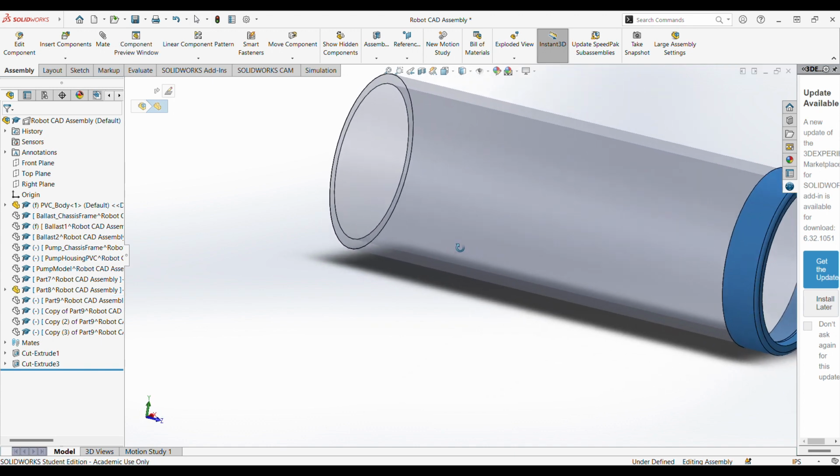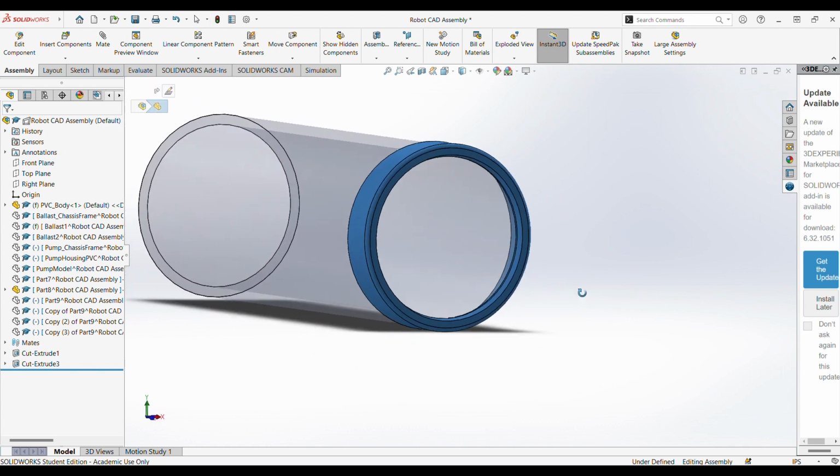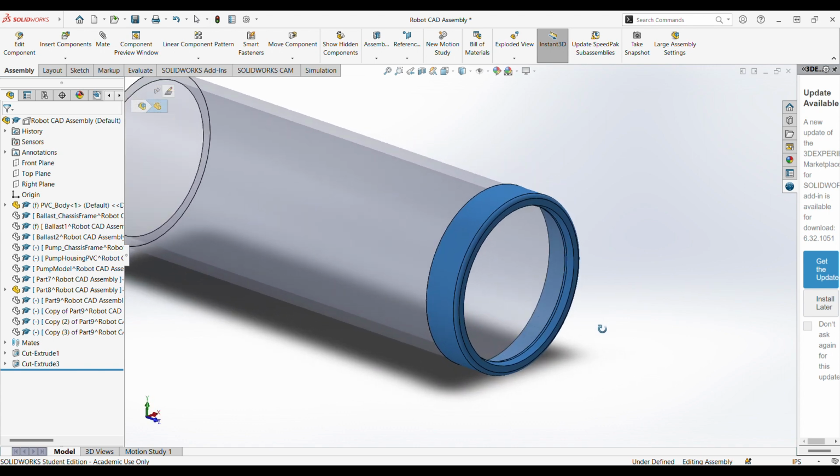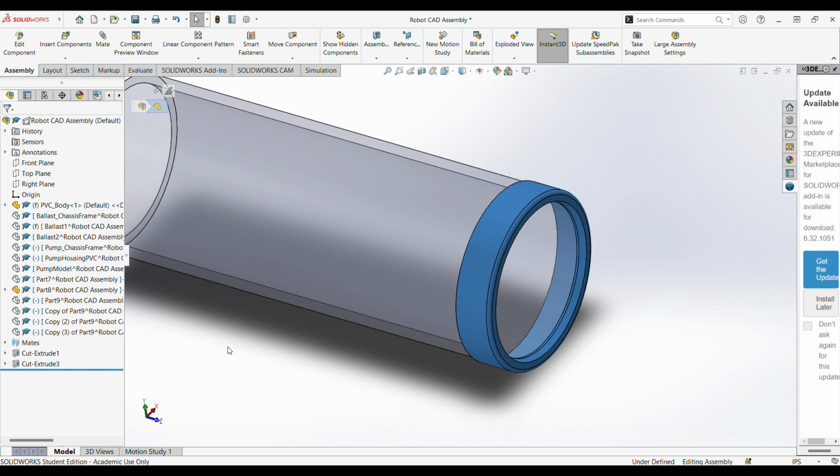And then I want to pull up, yes, this one. This is what you could call a lens frame, which is kind of a good term for it. The plan here is to have a piece of acrylic across the end of the PVC, and so this is to give a mechanical mounting point. I'll discuss this further in the hardware overview, but this is glued onto the PVC pipe and will hold the acrylic sheet in place over the end of the PVC pipe. Super simple part, but I think it adds a lot of rigidity and it came out really nice.